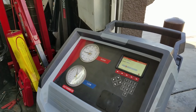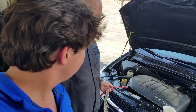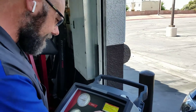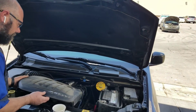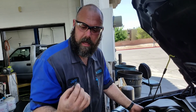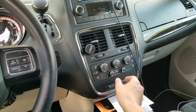We have approximately 8 feet of hose for the low hose and the high hose, so there's still some refrigerant remaining in the line. The machine tells us the next step: press continue to hose equalize. We continue, then it says disconnect high side service hose, connect low side service hose, and start the air conditioner on max. These caps cover your refrigerant service ports — if you do not put these on, your vehicle will leak out of that service port. A 10-cent cap can stop you from screwing up your AC.